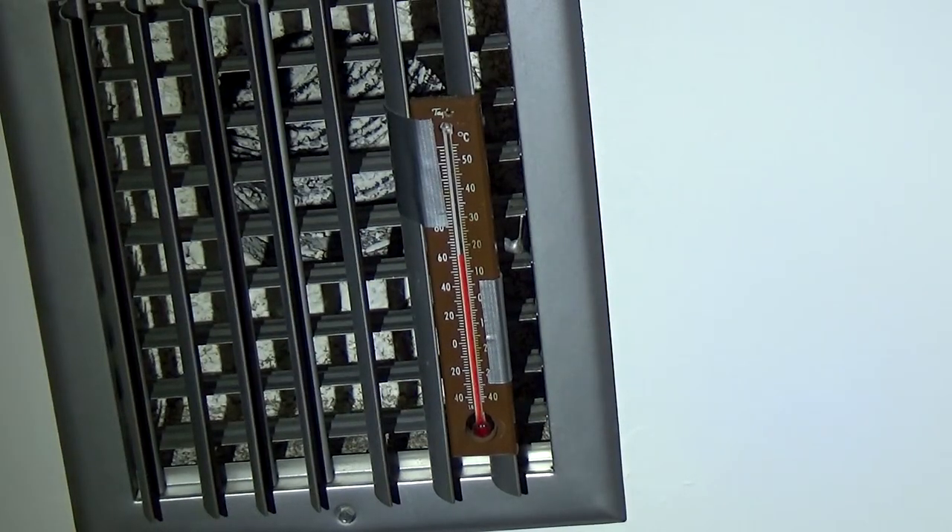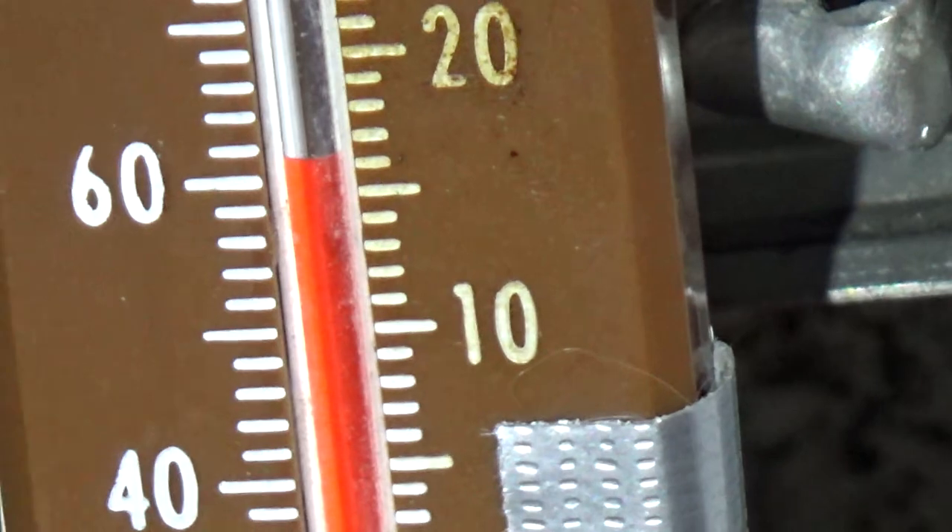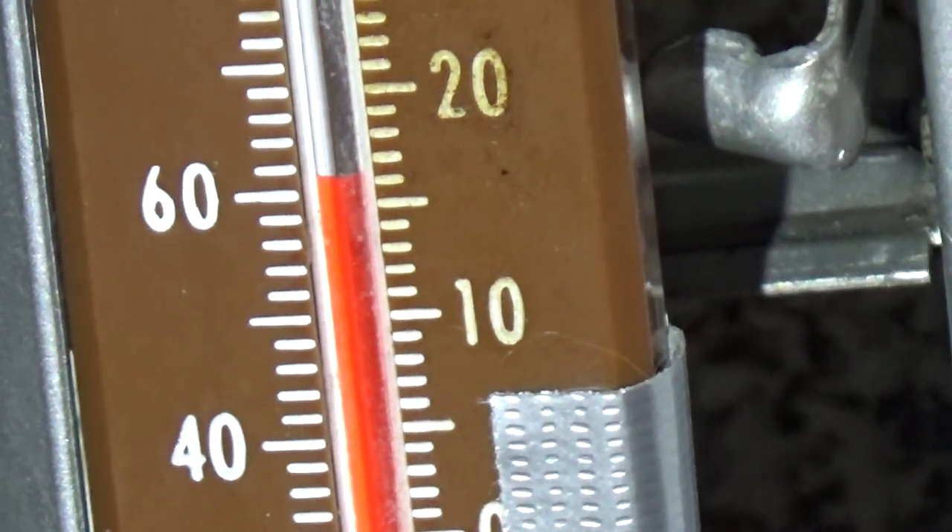If you put your hand to the vent closest to your AC and it's not freezing, just take your thermometer and check. I'm thinking 58-60 degrees is probably the average lowest temperature you should get. If your temperature goes to the 60s or 70s, it's not going to cool your house enough and your AC will keep running constantly. Mine was taking about three hours just to drop one degree — that's an indicator something is wrong. Right now you can see the temperature is dropping closer to 60 degrees — that's what it's supposed to be.